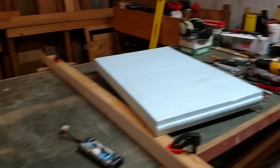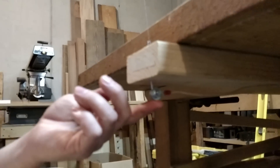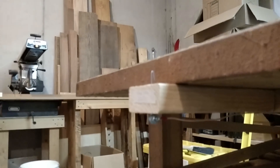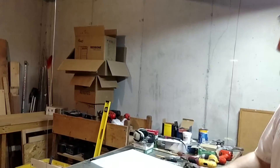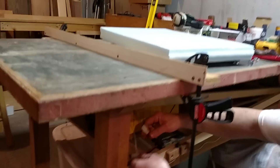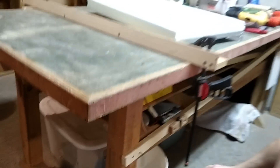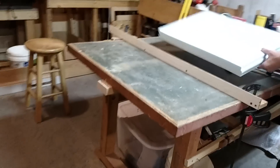I have this little device under here to hold the hot wire in place. You need to be very precise when you're making these hot wires out of nichrome wire, because if you're too long or too short, your resistance is going to be off. You have to tune the hot wire length to be acceptable for your power source. In this case I'm using 7.2-volt racing car batteries. I've wired up my workbench to use these 7.2-volt NiCad or nickel metal hydride batteries — a little on-off switch, one wire going up the wall over to the top, the other end going underneath to the little spring-loaded mechanism.